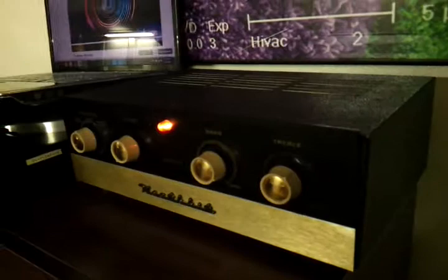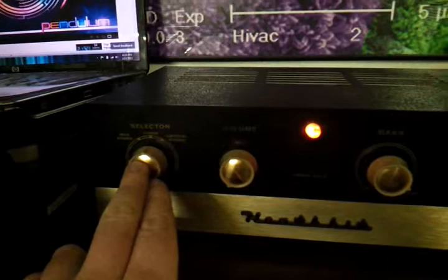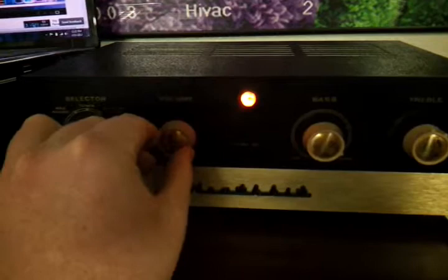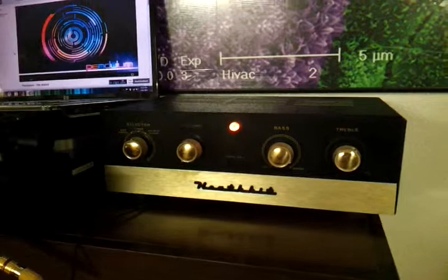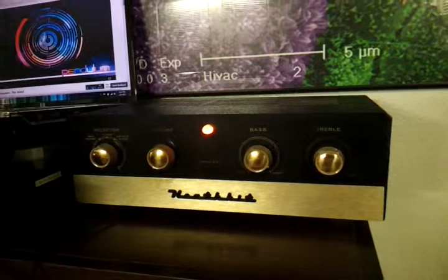Something else I did was replace the 470K ohm resistor to the tuner with a 100K resistor, and that gives the volume control a lot more gain — meaning I've got higher volume on a lower setting and a higher overall volume. It's a little overkill, so I'm probably going to put another 100K resistor in there to give it up to 200K, which is still a lot less than the original 470K, but I think that'll be a happy medium.